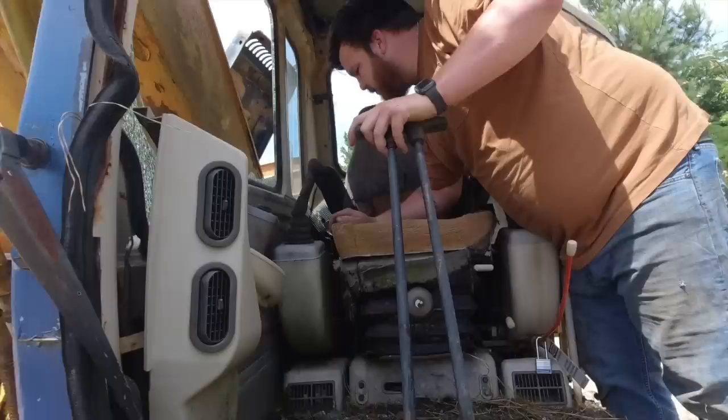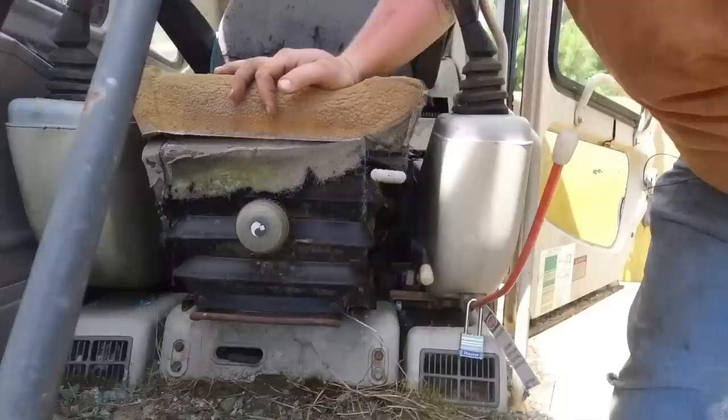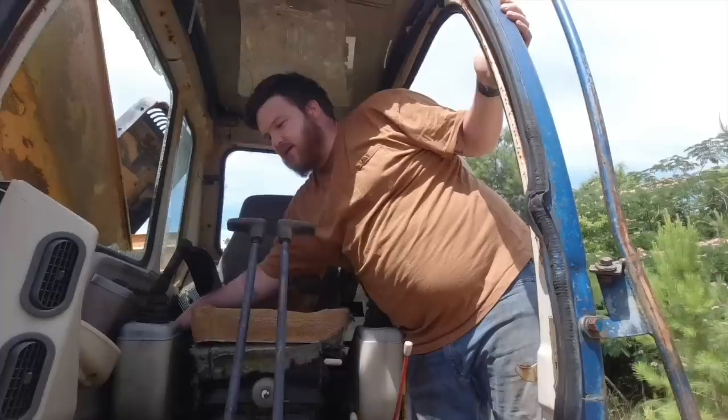I wonder if this has to be up to get a signal. We have an emergency shutdown button up here, though. And there's two wires that are disconnected on this seat switch. Looks like it. Well, see the blue tap? Yeah. Problem is, you would get a light, a chime, something, I feel like, in this instrument panel. The hour meter's not even coming on, so I just think we have absolutely nothing here.